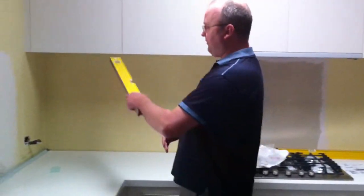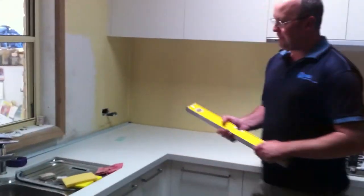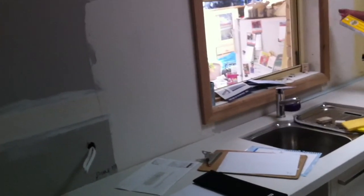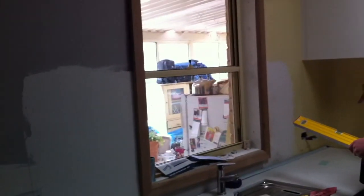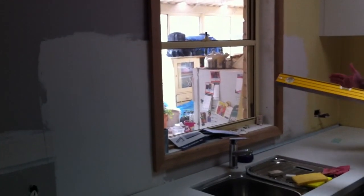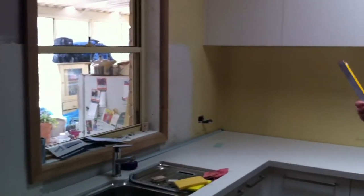So for example, if we're going underneath and back up, which is typical, when I measure them, the architrave here and here, I'll add a mil. Now the reason I'm adding a mil is because this panel coming into this architrave is going to be off by about, I normally allow 2 mil clearance. So this is going to be off 2 mil, that'll be fairly tight that size, sort of 1 mil or so, because we've got that return panel. But it basically closes the butt joint in, it closes it up. You've got an option to tweak it in and get it nice and tight. Whereas I've seen guys deduct a few mil off that tight size, and it opens the gap right up. So you'd have the join there and then. So you'd have a strip there?